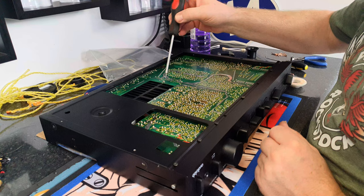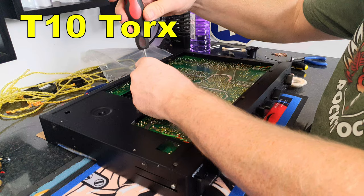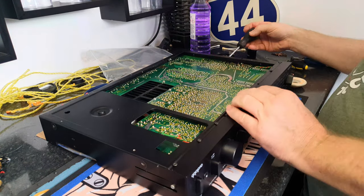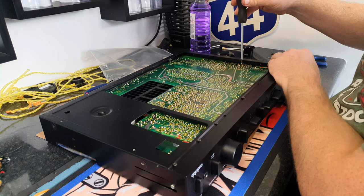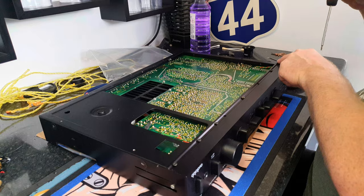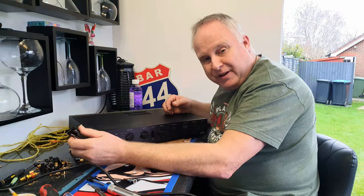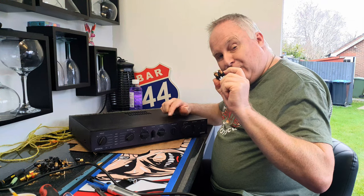Before putting the lid and bottom panel back on, go around the board with your T10 Torx and check that all these screws are done up — I found a few were loose so I've just nipped them all up. Don't forget the two on the side for the phono heatsink; you'll need to pass your Torx bit through the hole in the panel to do that one. Don't be tempted to tighten the screws along the bottom of the front panel until after you've slotted the bottom piece back in. If you've got value from this video, please consider supporting the channel — maybe buy your replacement phono sockets for your Audiolab from me — and I'll see you next time.